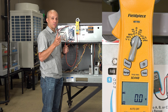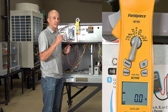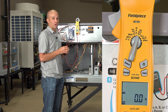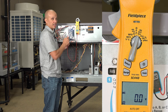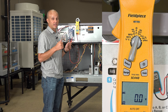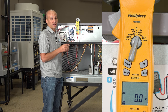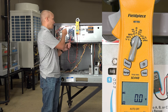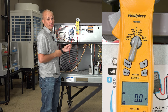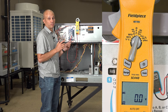This should help you out — we know how to troubleshoot the wire and we know how to troubleshoot the call. If for some reason the thermostat was definitely calling for fan and the fan was not running and I wasn't getting the fan call on here, I know I have further troubleshooting to do. I would go down to the thermostat, put the meter leads right on the thermostat output and see what it's doing — or more easily, I could jumper R and G there and see if the fan runs. Then I'll know which of those two devices is the problem. Hopefully that helps you out.